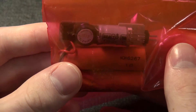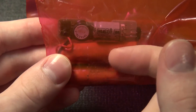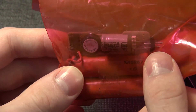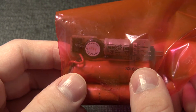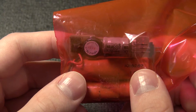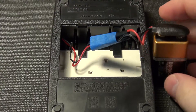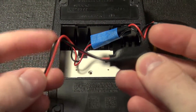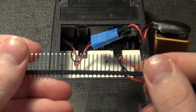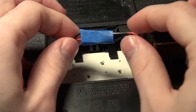And also in some way charges things and so on. But I don't care to try to replace these cells and clean out this horribly inefficient boost converter. I didn't have a charger for it, and so I'd end up having to make one — that seemed like too much work for something I could just throw a 9-volt in. Really simple upgrade. All I really did here is just take a standard 9-volt battery clip and use some 0.1-inch header on the thing.